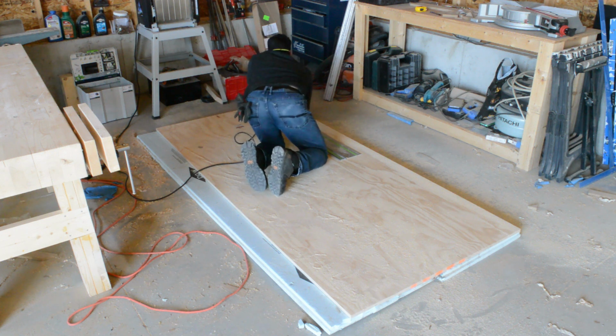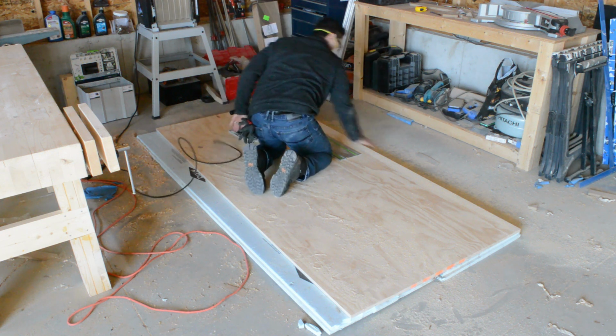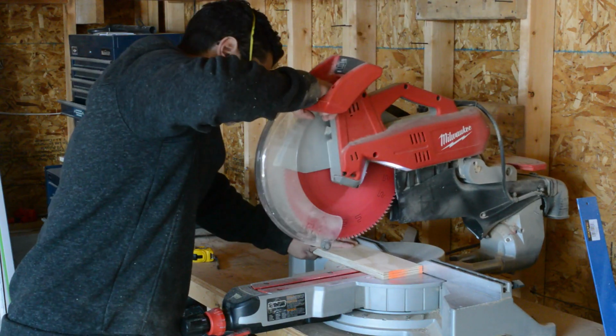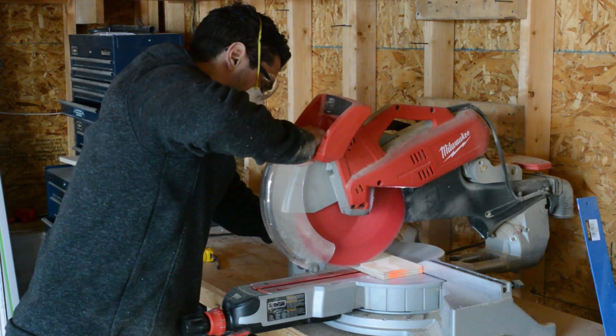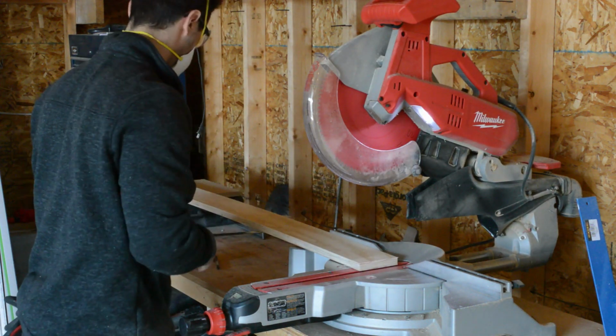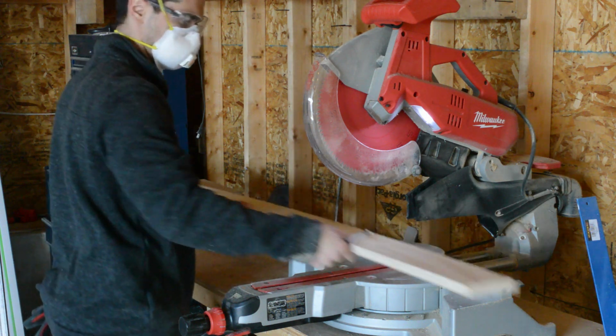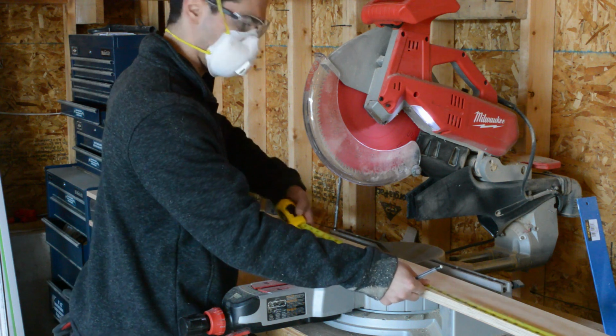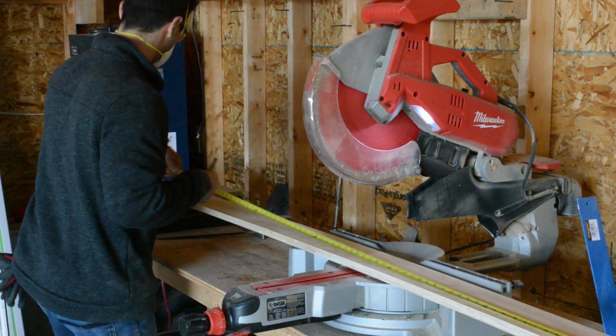That's pine, and it is sanded on both sides, which you see me breaking down into little strips as you see here. The rest of the construction is just regular 3/4 inch spruce construction grade plywood. These strips I'm breaking down are going to be used for what we'll call the beefed up face frame. They'll be glued and laminated together, as you can see me cutting all my different lengths here.